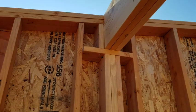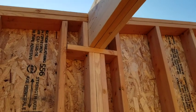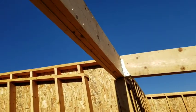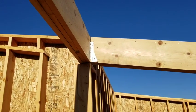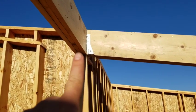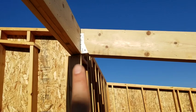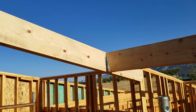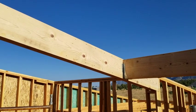Beams are done now. I'll do a little close-up on the beams here. So this one here is the big one — have the joist pocket there to put that into, so that's supported well. All the way across we're done. And close to that wall there, we have the next beam set up with the joist hanger on that one. And between this one and this one there are big lag bolts holding those together, and then from the bottom up there are bolts holding it to the wall.